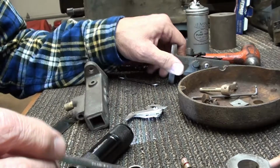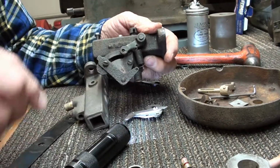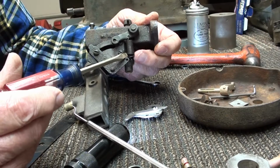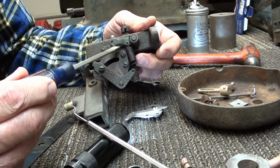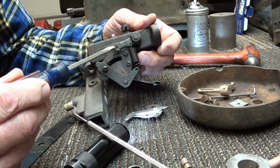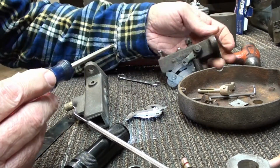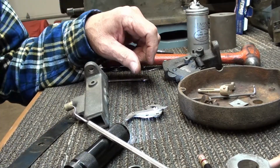And this, on the old one, is a speed controller. You loosen this screw, and this spring is attached right here. You loosen this screw here and change the spring tension on the governor, and that changes the speed on the engine. So that's your speed change right there. Of course, this is your main fuel mix. So that's just a little more explanation in case one of you guys is working on this particular setup.